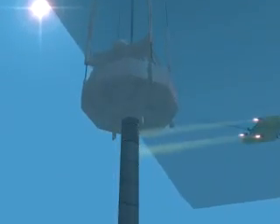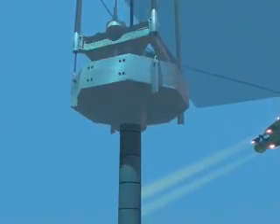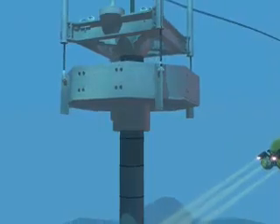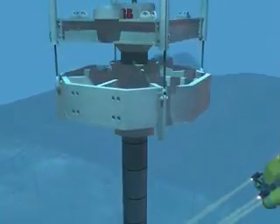As shown, the structural casing is run with a permanent guide base, or PGB, attached to its top joint. In this example, an accessory temporary guide base, or TGB, will be run simultaneously with the structural casing, and slung below the permanent guide base.